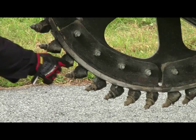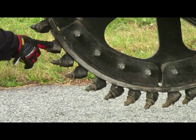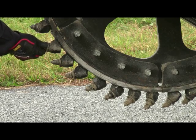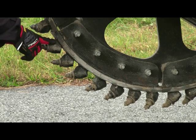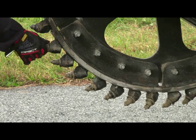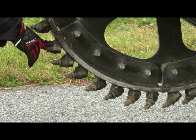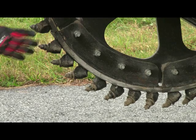And the holders are welded on to each section. As you see, there's 7 holders per section, and your fittings or your teeth bang into the holder. So it's important that as a holder, you want to protect the holder with the bit. The bits themselves, and we'll talk a little bit more about the bits and how to keep them maintained and so forth, but they protect the holder. If you were to shear a holder, again, you would have 2 options.